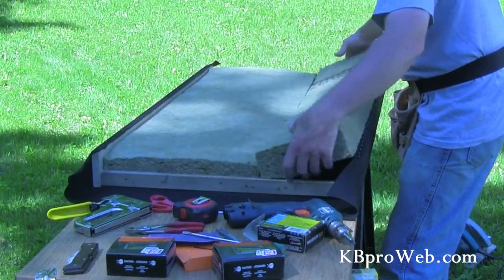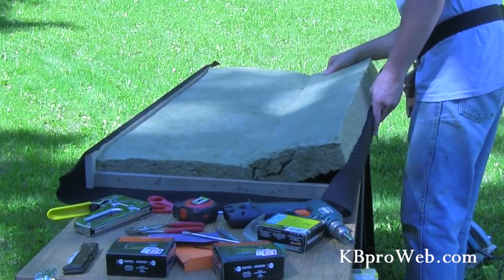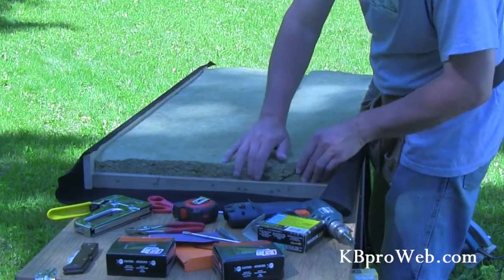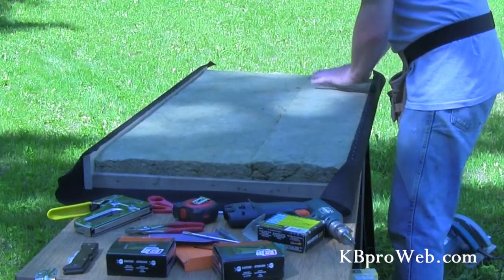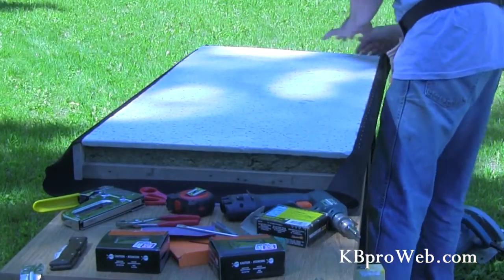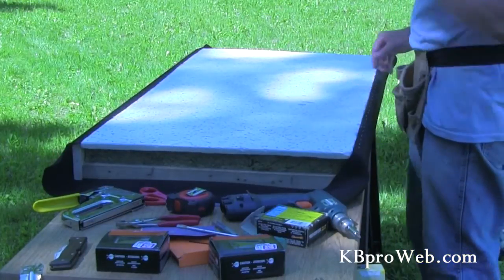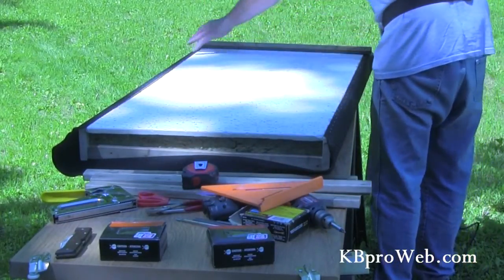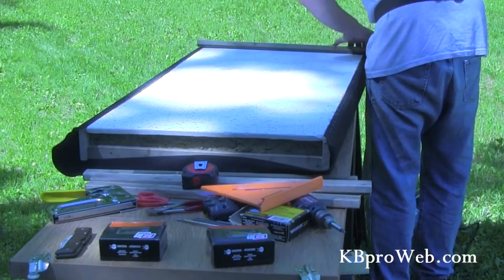Take your two bats and stuff them into the panel. You want the insulation to go in fairly firmly but not bulging out. Then lay your acoustic ceiling tile on top — if your sides are bowed in, bend them out a little and pop the tile right in. You want a snug fit without breaking anything. Then attach your one-by-two back braces, which fit right across the top of the acoustic tile to hold it in place.